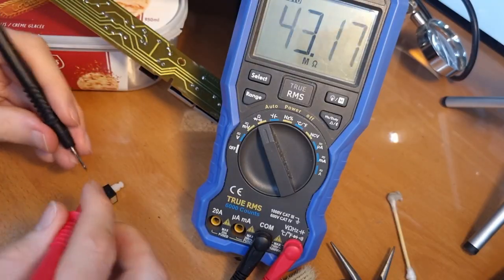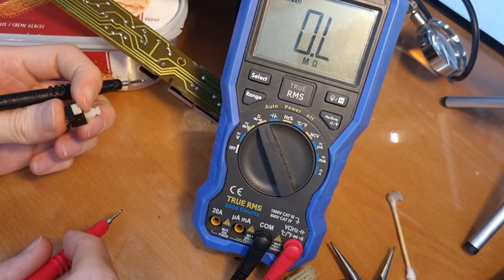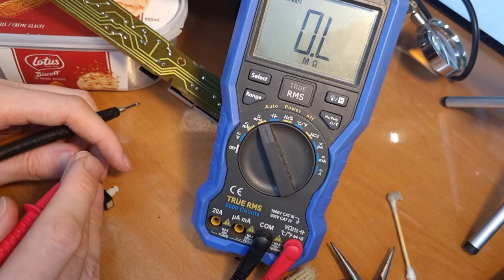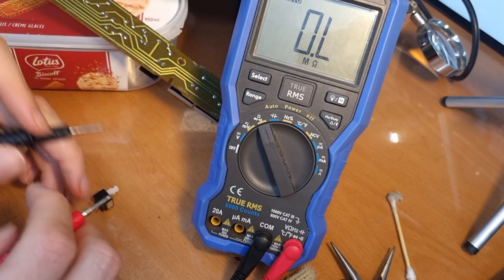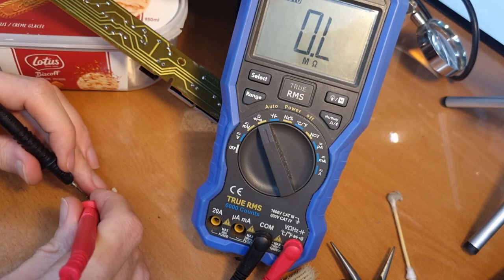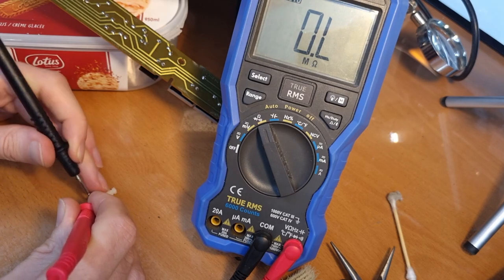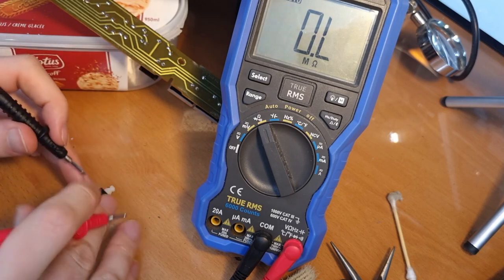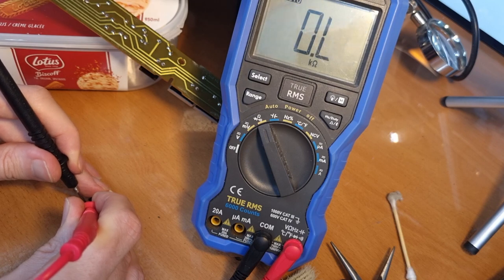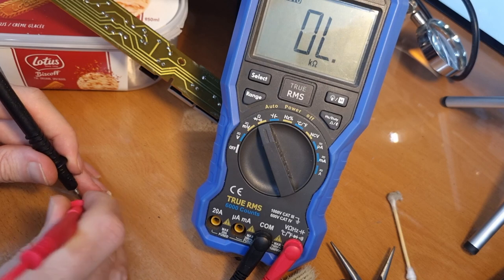Okay, so the switch contacts have been cleaned, washed, and lubricated. Well, yeah, I applied some lubrication and oxidation protection, especially for sliding contacts, and see what we get now. This is the first contact. It probably should be pushed in the other way. That's perfect. That doesn't get any better than this.